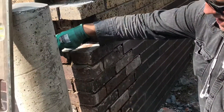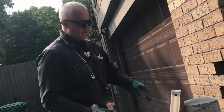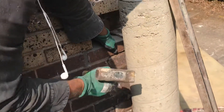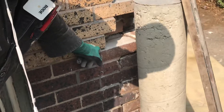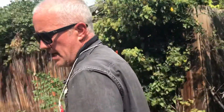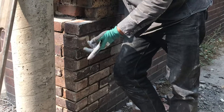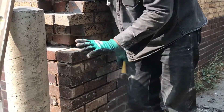This brick is kicked out right here — I can see it coming around the corner — so I'm going to come back around to this side and tap on this one until I get him back where I want him. He's a little loose; we're going to chisel or grind these and tuck point them in. This guy is way in from the corner — you can see that brick to that brick — so that's not good. We want to pull him out.